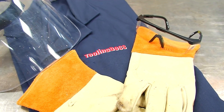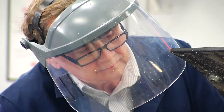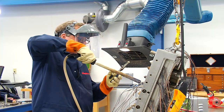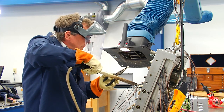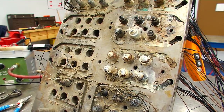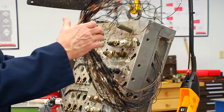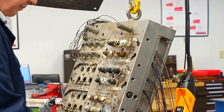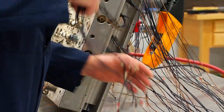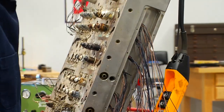Make sure the necessary safety equipment is present. This includes a full face mask, heat resistant gloves and a shop coat. A vacuum system to draw off as much of the smoke as possible is desirable, as is plenty of light. Tilting the mold back at about a 20-degree angle is helpful to get it into a more comfortable working position, resulting in better control of melting and separating the wires. The objective is to see exactly where the wires are routed through the channel and to which heater, so the wrong wire will not be pulled and broken.